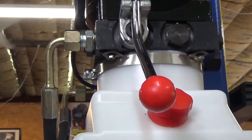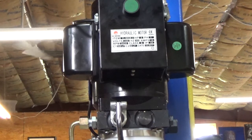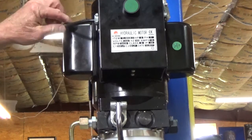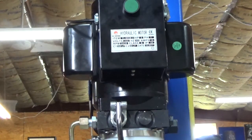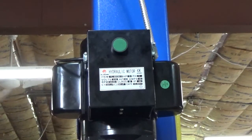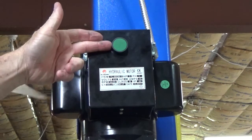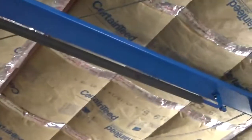On the wiring, it's a little different in that you have to wire in the limit switch from the top. You wire it to the normally closed side on the switch - it'll say NC for normally closed. The wires connect there, run down on the inside of the lift, and come out here. You'll put a little strain relief here, run the cable inside, and that will connect to the wires inside the box. Then you wire that into the 220 as it comes in - take one of those wires, wire it to one of the wires coming off the back of the switch that continues to the motor. You only do that on one.